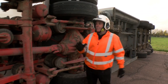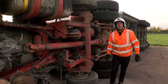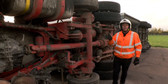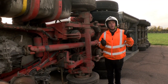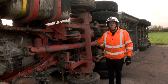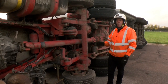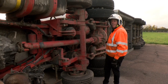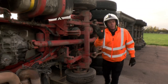As we walk through here, now would probably be a good time to disconnect the driveline because it's nice and easy to get to. If you think you might need to wind some brakes off, do so — but don't forget that for safety's sake we need to have some kind of brake on this. Disconnecting the red airline is a good start, and maybe some wheel chocks. We haven't put any here yet because we know we've got brakes on the front, brakes on the back, and all the trailer brakes are on because we've disconnected the red line.